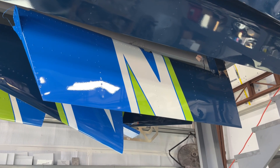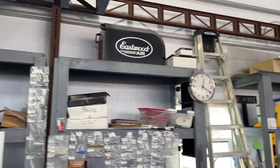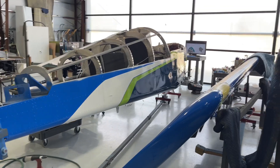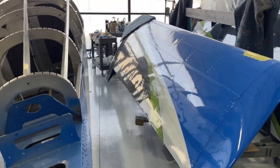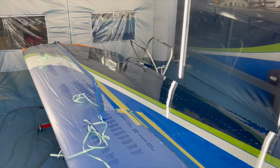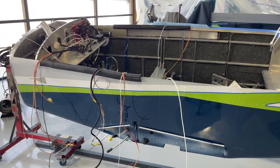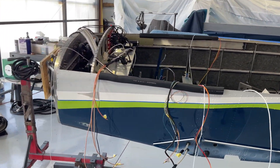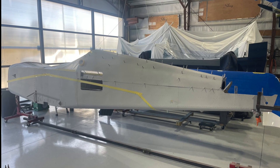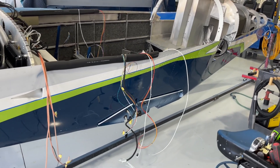Here's my rudder — that probably took three weeks. You've got to etch the aluminum first; that's where you start. You etch it with a chemical etch, let it dry, and within 24 hours apply the primer. These are the wings — I've got both wings painted now. You apply the primer, sand the primer — that's two coats — and then you can start masking.